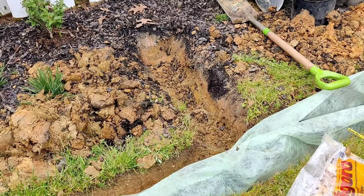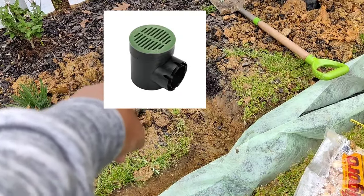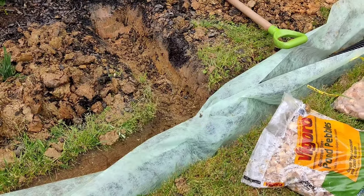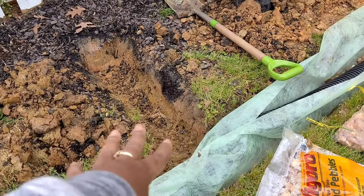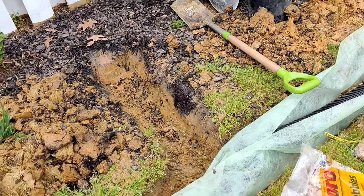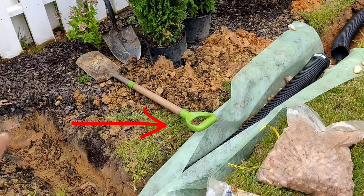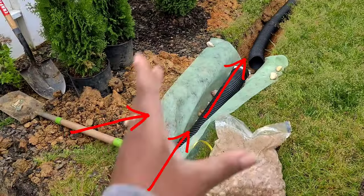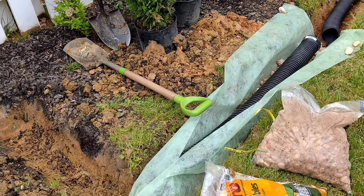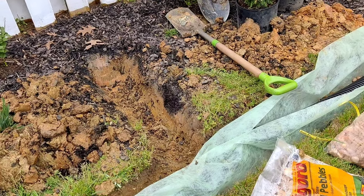Good morning — I just got back from Lowe's and this is where I left off yesterday before my camera died. I did dig an additional trench here — this is where I'm going to be putting a catch basin to catch all of the water. My brain just automatically goes into 'just dig it and connect it directly,' which is not the best way for this to be set up. So I'm going to fill this back in and redig my trench — I just think of T for some reason. That way the water can flow from this direction down, and also from this direction down, so everything is going in one nice flowing downward direction instead of the water having to turn the corner twice.